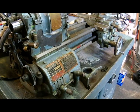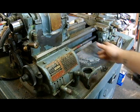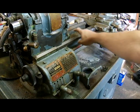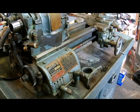I'm going to take it all apart, give it a nice cleaning, painting — the whole works. I expect this to be a quite a few video process — not two or three videos. I'll be working on it in chunks. In the next week or so I'll make an initial video disassembling the headstock, removing the carriage, the apron, the quick-change gearbox, and the lead screw. I'll also take the gear train off that's attached to the bed, then strip it all down so I can take the bed to the grinder. I'm going to dunk the bed in Purple Power and paint remover to have it all cleaned up before grinding.